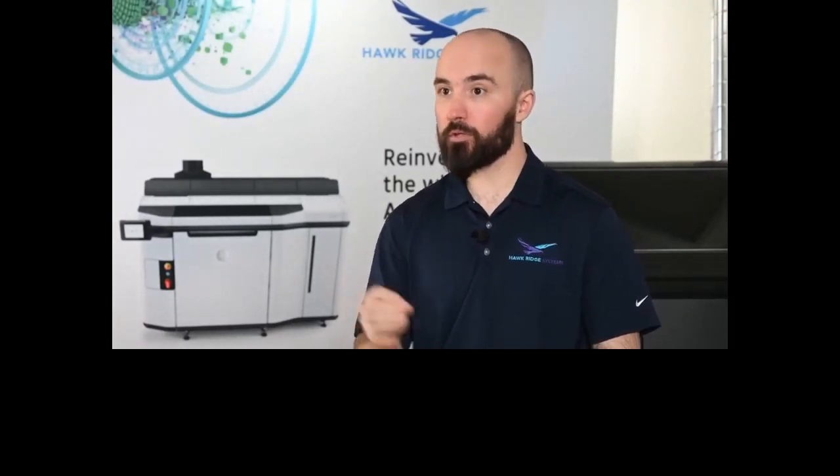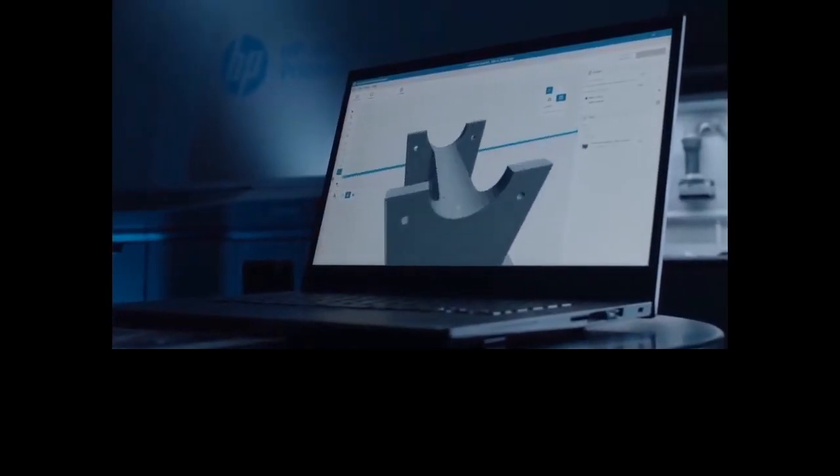For this project we chose our HP 580 printer for its ability to print in full color. Using the SolidWorks CAD model, I created a build using the built-in build manager and placed the bindings in the middle of the volume. We were able to get the bindings out of the printer the next day and begin testing our current design, which was extremely beneficial as we tested multiple parts for strength and fit with each other and the boot.